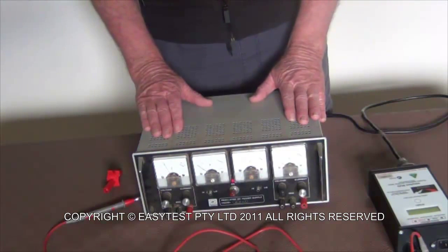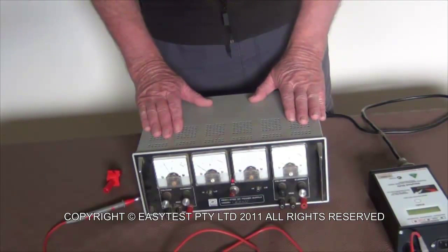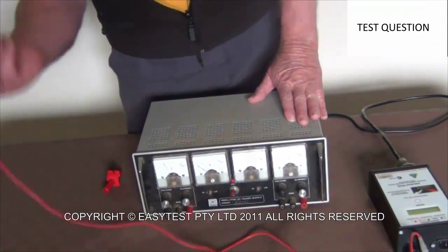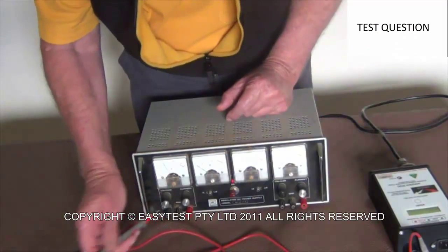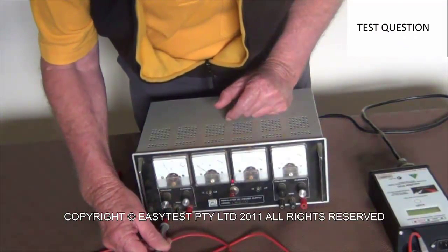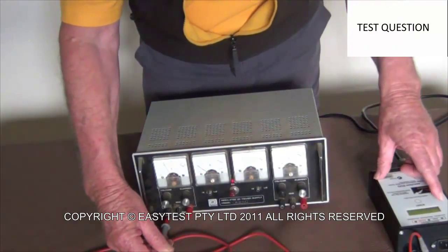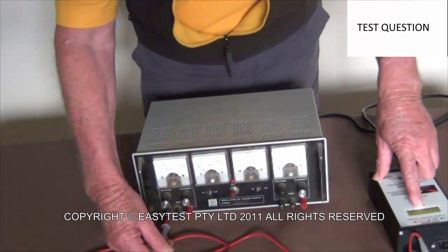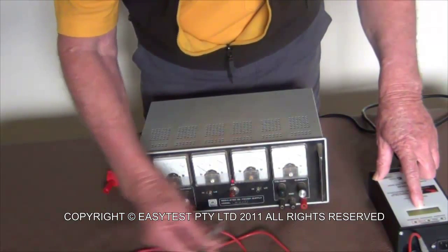There is always an exception, but you'll hardly ever see an auto transformer in the field. I'll do a different section on them, and I'll show you how to identify them. So you must check from the high voltage to the low voltage, and you do that by touching your probe to any exposed metal on the low voltage, and it will show up as an earth leakage.